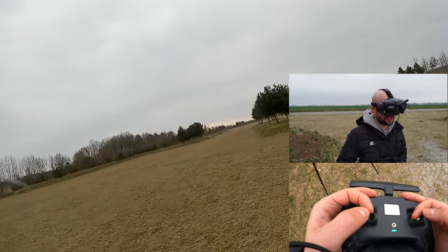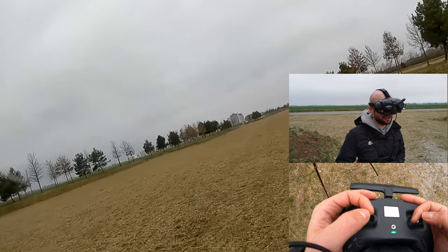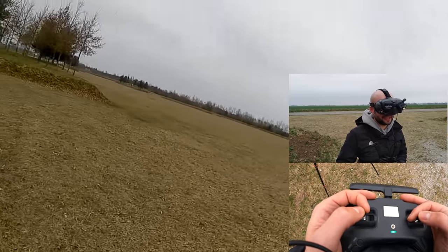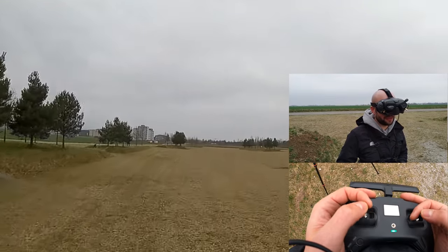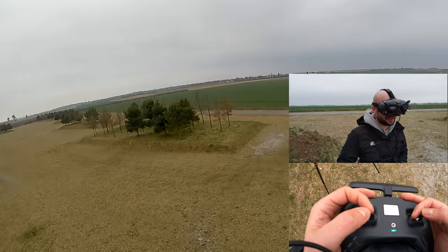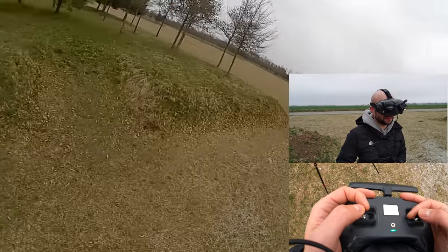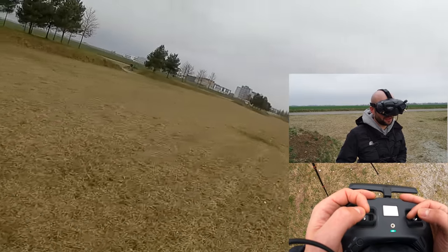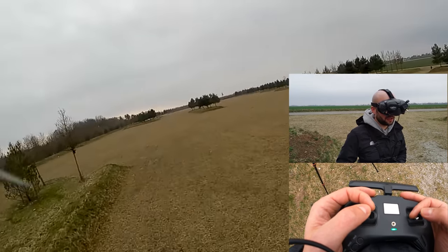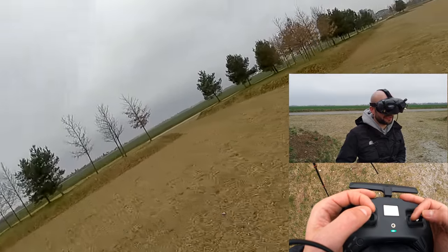We're 2 minutes in, at 3.6V. I have the impression that maybe my voltage sag is slightly higher than usual, but really like maybe 0.1 to 0.2V, and it's also quite cold. So I'm not seeing anything really surprising. Let's do a little punch shot to see what happens. It drops quite a lot, but that's also absolutely normal. It really behaves very, very close to how these packs usually behave. Considering the temperature we have today, this is what I usually see on these packs anyway.